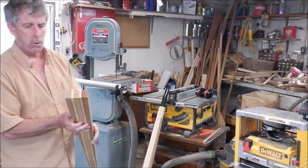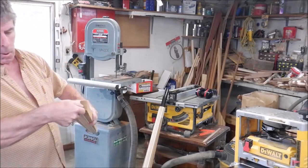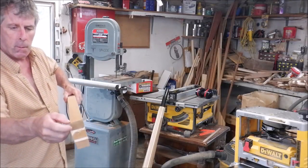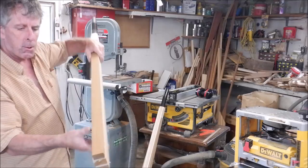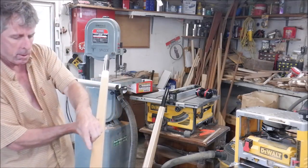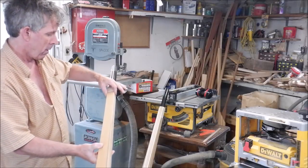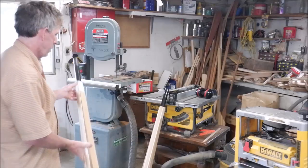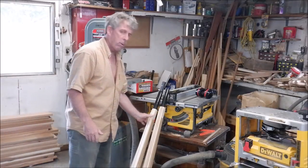What we're going to do next is mark a center line on the end of the paddle and then two secondary lines spaced out a little bit, and transfer that onto the sides. That center line will be drawn here, and then profile lines from here down to where we want the narrower part of the blade. I'll be back to do that in a couple of minutes.